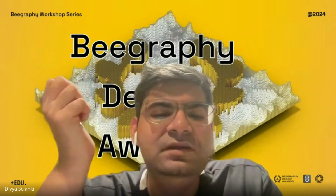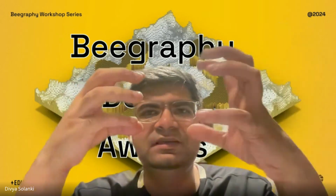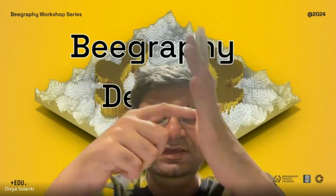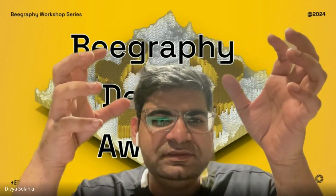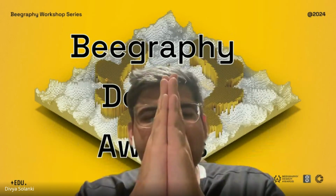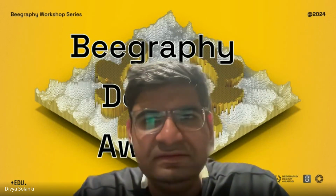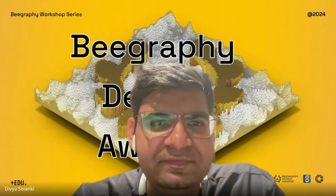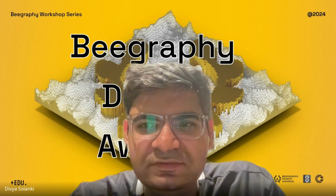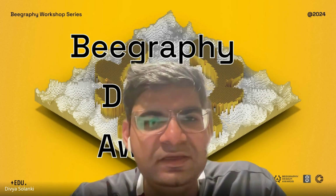So even Rhino has Boolean problems a lot. If your object is just touching at a point and not completely going through another object, sometimes it won't Boolean properly. So if two faces are just on each other, then sometimes it can cause an error in Rhino as well. They need to be through and through most of the time. There is one issue I'm aware of: if it's just touching the edge, then it will have a problem. Like if it's tangent. Yeah, that also.